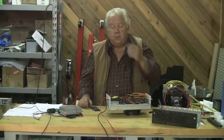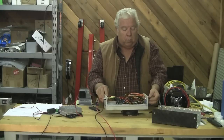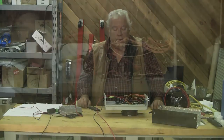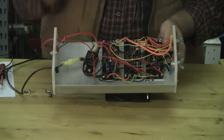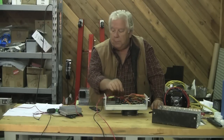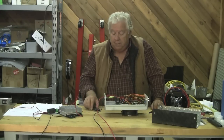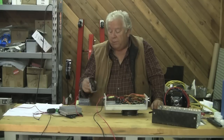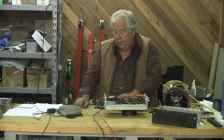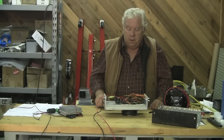I put a little LED on the front. As it turns out, it doesn't really indicate anything, and I'll explain why in a little bit. I've also got two output terminals — just bolts through some mylar material. I put one capacitor across the input of the first brick; the bricks are wired in parallel. It's a 600 volt, 10 microfarad capacitor, just to take out noise spikes. It's not going to cause a problem if you suddenly hook up power, but it takes a little of the noise out. The outputs and inputs are wired in parallel, and we trim the output voltage with a 90K resistor for 12.8 volts.